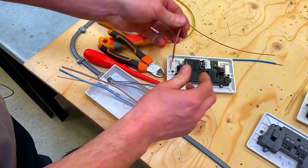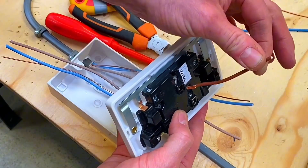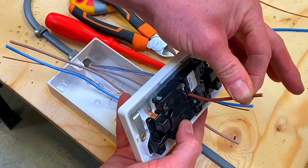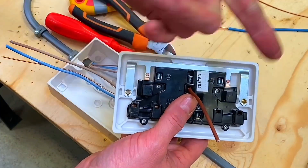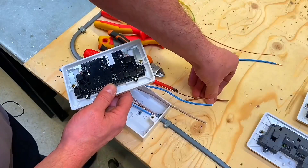Let's see the depth now - that's not very deep at all, but some are considered deeper than that. That will work. Students, remember to have a little practice first and get used to how far we're going in the line connection. Neutral will be the same, but often the CPC has a different depth so we'll have to practice again when we get there.